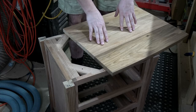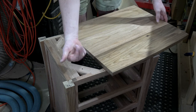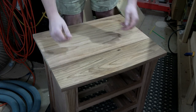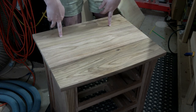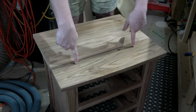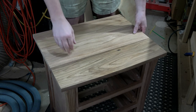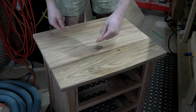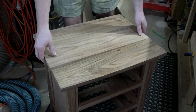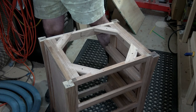Before I attach these tops, I just want to enlarge these front holes to allow the bolt to wiggle backwards and forwards a little bit to allow for expansion and contraction. The back bolts won't move — they'll just be vertical. The front bolts will be able to shift backwards and forwards. I'll give it a few millimetres of clearance. It only needs to expand about 200mm, so 1% of that is 2mm — a couple of mil. She'll be right.